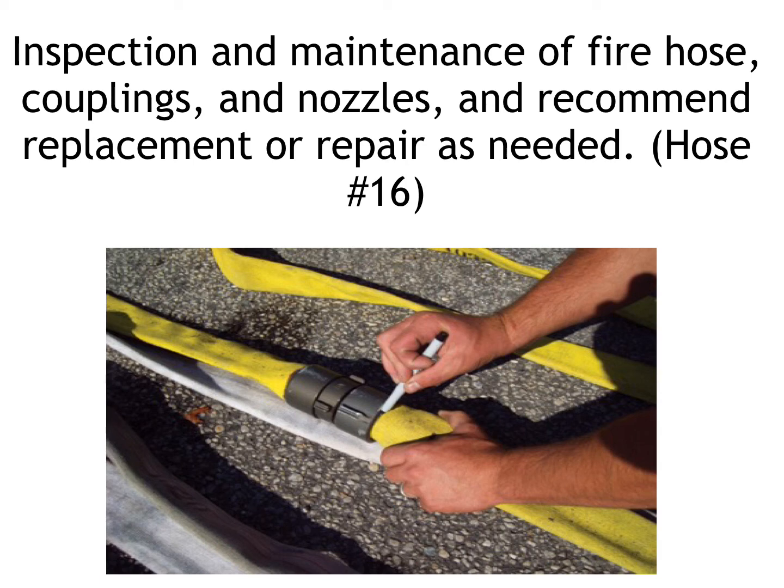And then lastly, check the couplings. Make sure the couplings haven't slipped. The one thing I'm going to add to this is if you've never done hose testing, you don't just run out there and decide to go do this one day. Remember, you're testing equipment at its absolute maximum. If the equipment fails, it can kill you.